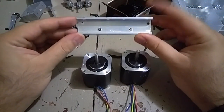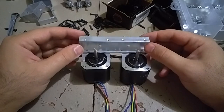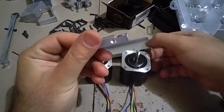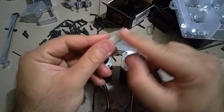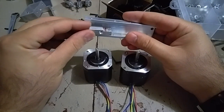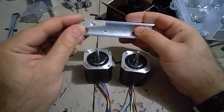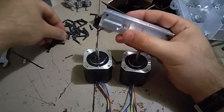The two holes here — one, two — these two are going to face down. Then this part, we're going to tighten it here. In order to hold it, I need two other parts: it's an aluminum bar, three-eighths, milled on one side. If I put it here, it's going to sit here. There's a nice chamfer in this area — it doesn't have it on the other side — and this is going to seat toward you.